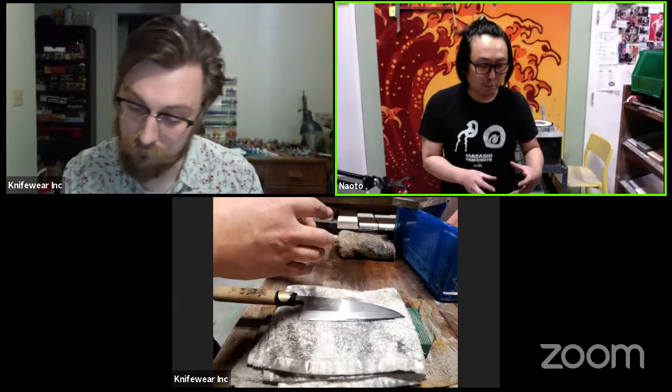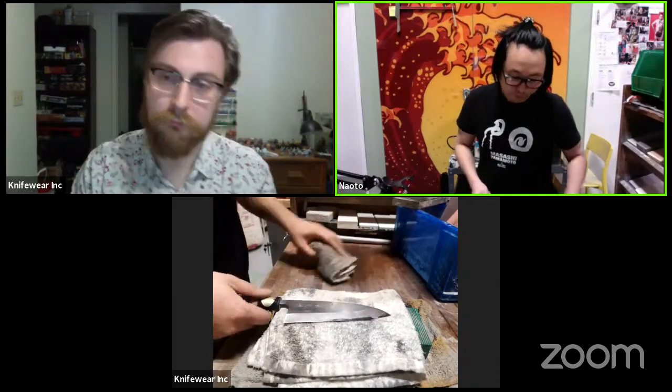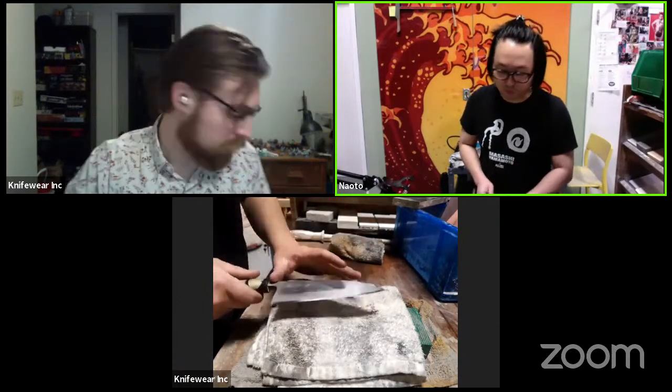Natural stone can get really close to the mirror, but there's always a little bit of a reflection. That's because natural stones are made out of so-called abrasives, but not really. Oftentimes they call it fossilized microorganisms. They act like abrasives, but the sizes of those abrasives are not quite even. In order for a stone to make a mirror polish, you have to have just one same grain all the way. Otherwise, the light comes in and flecks out in all other directions. So it's going to refract light a little differently. So between natural stones and synthetic stones, synthetic stones are definitely the way to go.